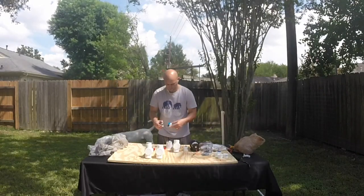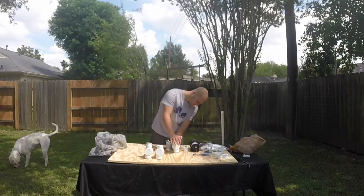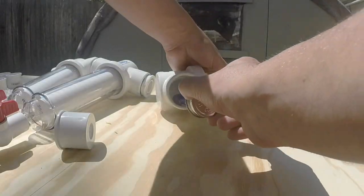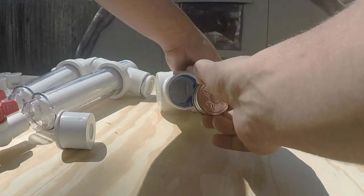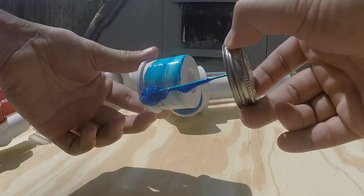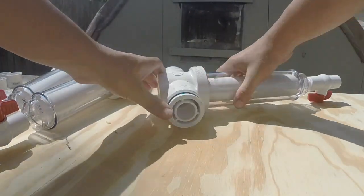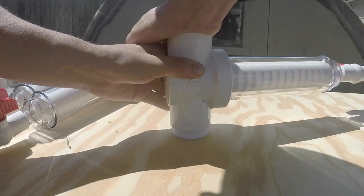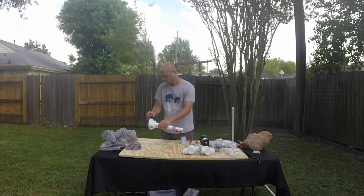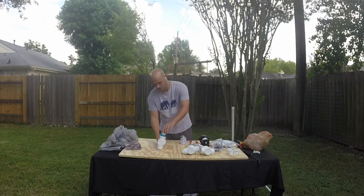Here I am putting glue inside the Rusco spin-down filter and putting glue on the reducer. I probably should have put a little bit more glue — again, I was lucky and everything turned out okay. Make sure you press the reducer all the way in and hold for a few seconds to ensure a good seal. One tip: work quickly when working with PVC glue, especially this blue glue — it dries relatively quickly. If it gets too dry, it will not have a proper seal.